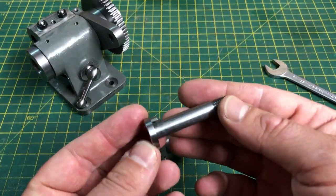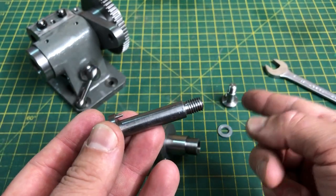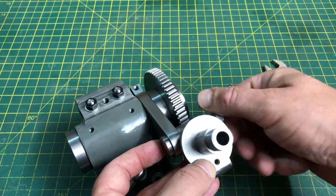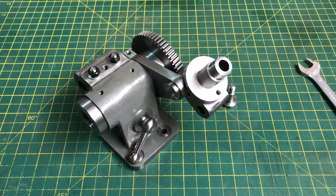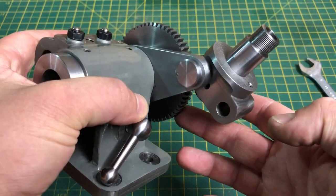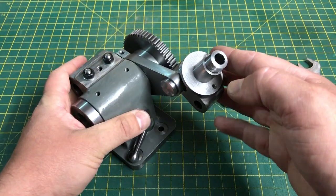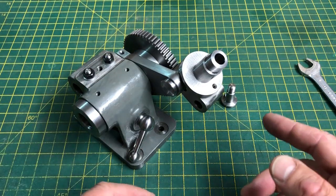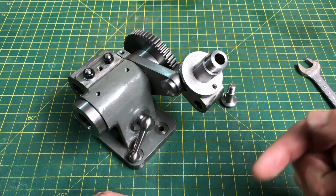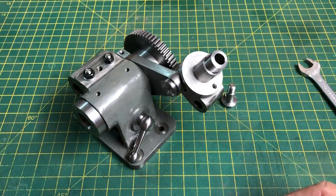It mounts to the body using another pinned bolt. I didn't film making this, as the process is exactly the same as the shorter one from the plunger video. And there it is — hopefully you can see how this is going to work. The worm shaft will pass through here to engage with the gear, and then the division plates are going to be carried indirectly on here. Well, I think that draws this part to a close. Next time I'll be making a start on the worm shaft itself, so please look out for that if you're interested. Do leave any thoughts in the comments, and if you do want to see more like this, please do subscribe. Cheerio!